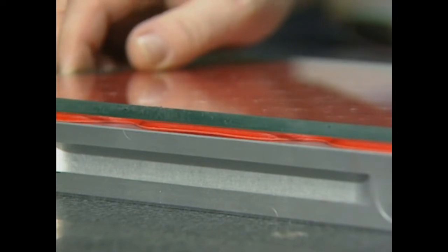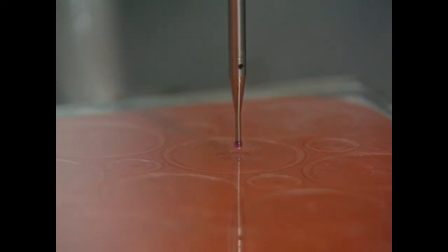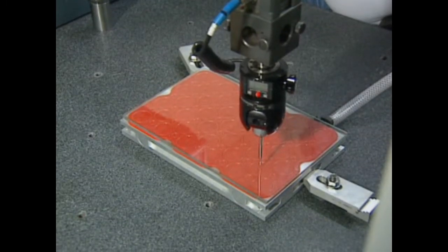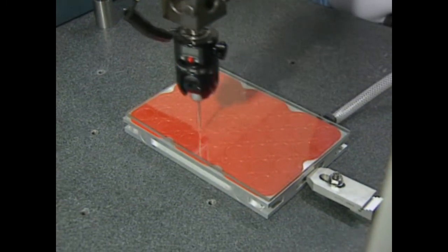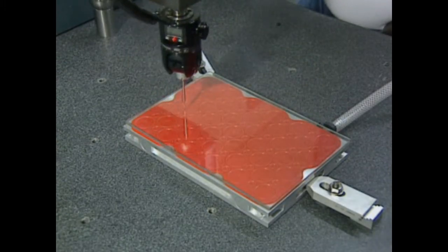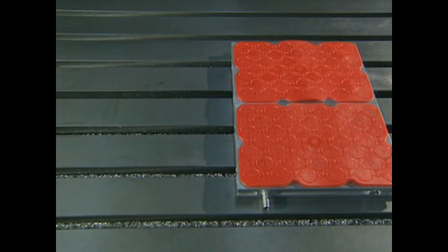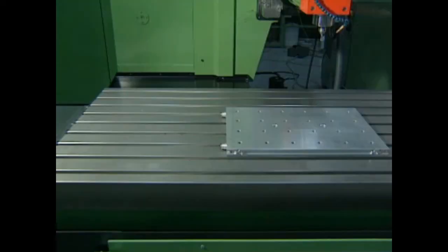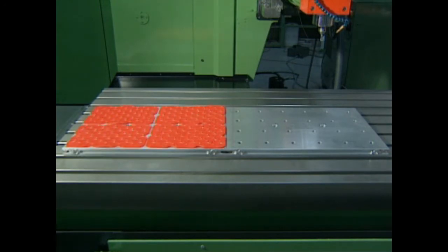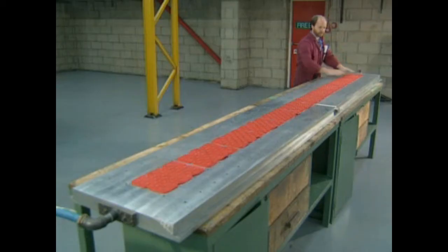The parallelism of the VAC mat is guaranteed to plus or minus 0.02 millimetre, or eight-tenths of a thou. The VAC mat here is undergoing inspection. Mats of varying density are available to suit specific applications, which can be discussed with our engineers. Vacuum plates can be supplied in various modular configurations and are made under licence in different countries around the world. Specially designed plates are also available.